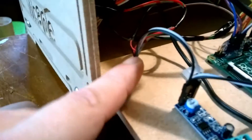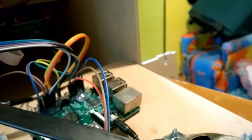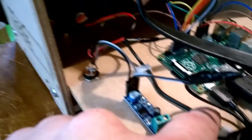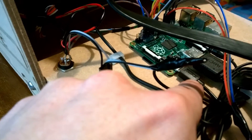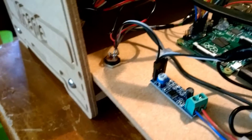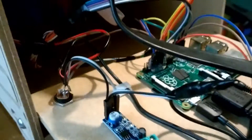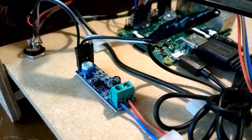What is important here is that we tie all the power positives and the grounds together. You can see that we've got power going up to the screen, and we've also got a connection from that ground to our Raspberry Pi as well, so they're actually tied in. The Pi is powered from the same point — directly via its micro USB connector connected through to our power supply. This is all powered from 5 volts; I like to use 5 volts at 2 amps. The rule with amperage is you can have more than what you require and devices will only draw what's needed.